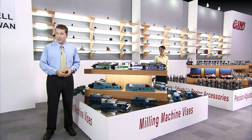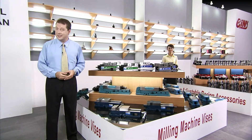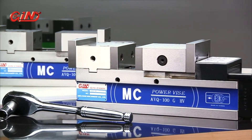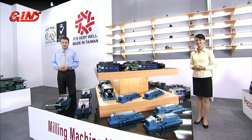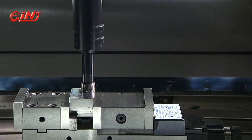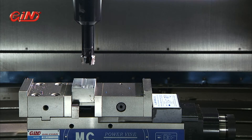The 5786 mechanical power machine vice is a real class leader and far exceeds JIS standards with its 5,500 kg clamping force and HRC 45 flame hardened structure. This vice has two key patented features that dramatically enhance its performance. The Lockwell anti-lift mechanism prevents workpiece lifting during clamping and maintains the precision of your machining. Additionally, the patented mechanical booster system maintains a steady clamping pressure during shock and vibration with the aid of its unique disc spring inside the mechanism.